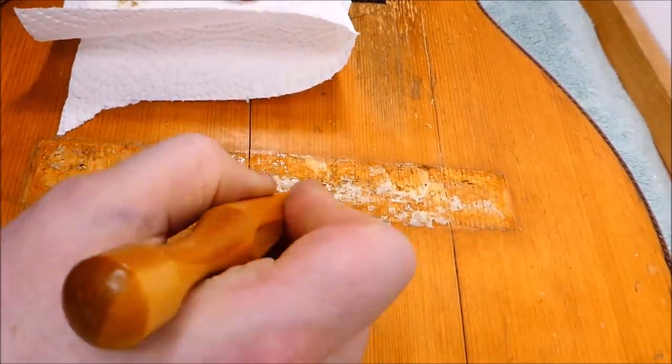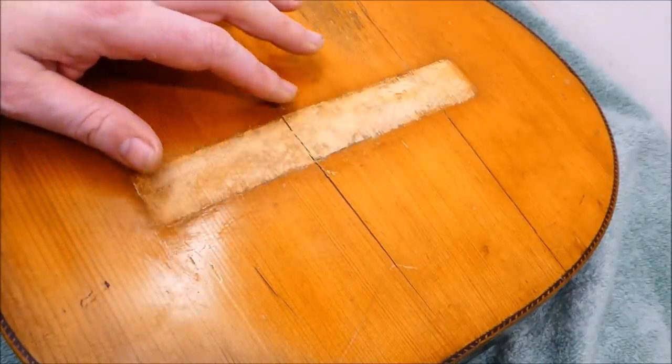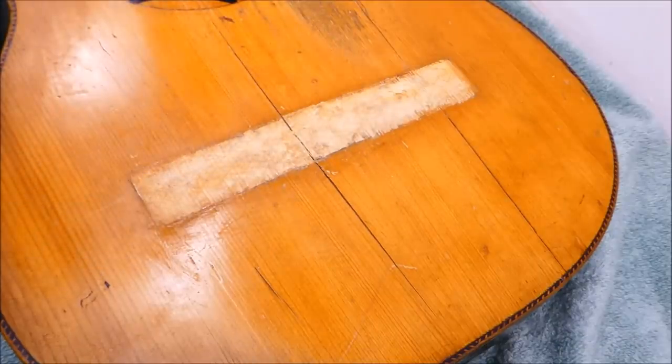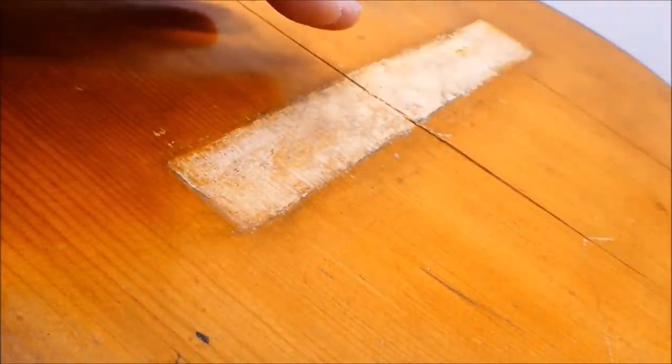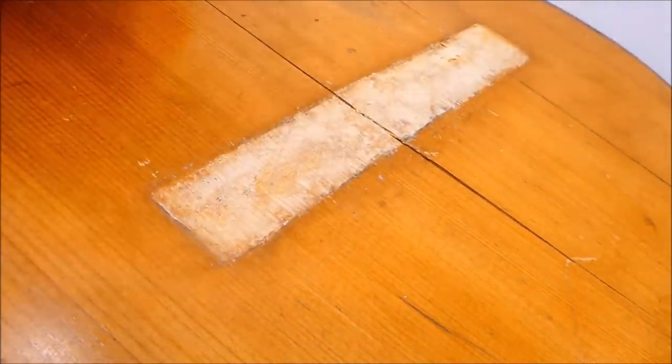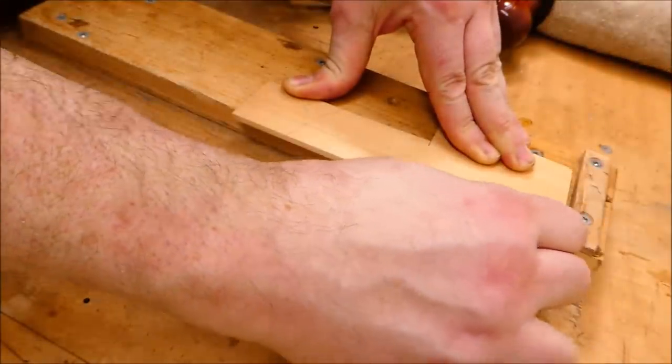The cracks — how to deal with them. This one especially: there's no way that's going to close up. It's possible — if I force-humidified it by putting it in a bag with some wet towels for a week it might — and that's a technique I use in other situations. But chances are it would just open up again when it's stabilized at the ambient humidity around here. So I'm just going to accept this top's assertion that this is the size it wants to be here in its new home and work around that. The other issue is this is very far from level, and before I can spline it I've got to get it closer to flat. The way I'm going to do that is to glue cleats in first — they'll help hold the two halves in place when I install the spline.